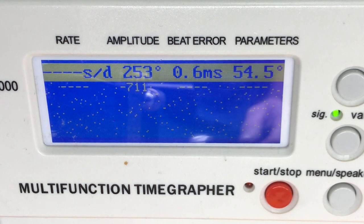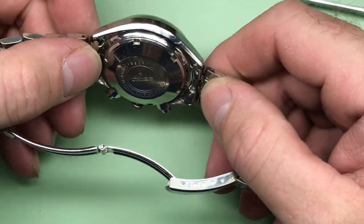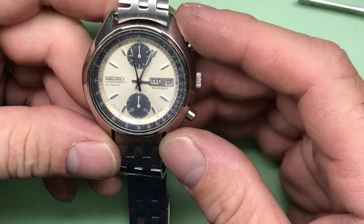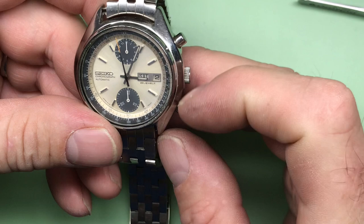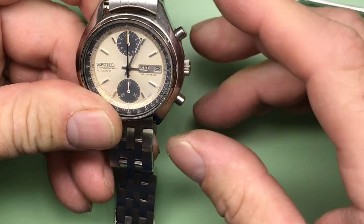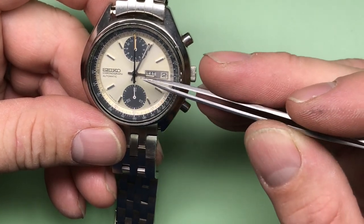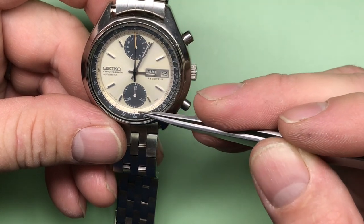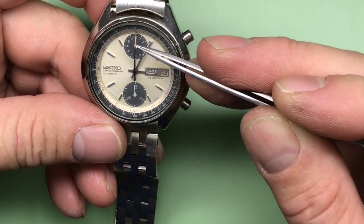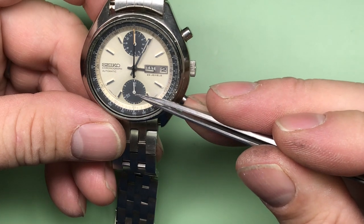We're going to start on the process. Okay, we're back. So yeah, we're going to get started. I'm going to send you this video. We'll take a really close look at everything and make sure that it's perfect for the return. Hopefully all of these hang-ups here are not anything more than something minor. I believe it has something to do with the minute recording apparatus. There's a wheel in here that interacts with the chronograph wheel, and there's a finger that needs to tip things over. I think that's stuck. So I think if we fix this, we'll be okay.